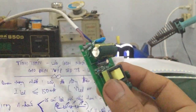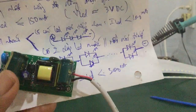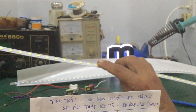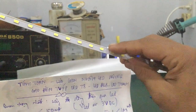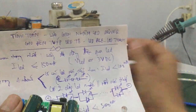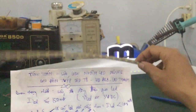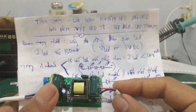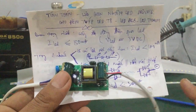As I mentioned in the previous video, the voltage drop issue is caused by the LED chips operating and pulling the voltage down, because inside those LED chips there is resistance. At the same time, the circuit traces also have resistance, so it pulls the voltage down. When you measure the no-load voltage it feels quite high, but when you connect the LED strip and measure again across the strip terminals, the voltage drop increases, meaning the measured voltage decreases.